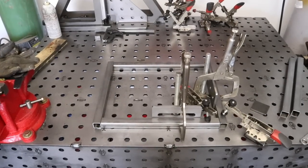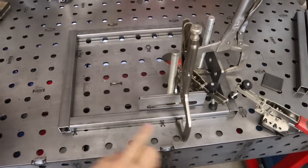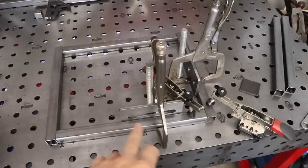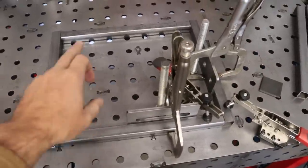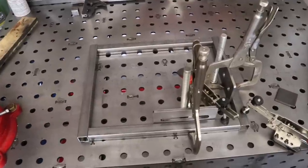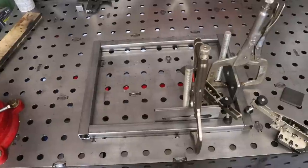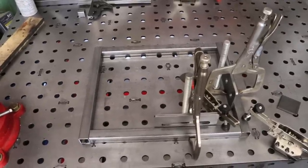Okay, so the next step is going to be making the top of the cart. These two pieces on the sides are just going to be your normal 13.5 sliders. These pieces here are going to be 14 5/8 front and back. And that's going to set your width for your totes. And I set this pretty close so that when they go in, they don't get cockeyed or anything, they go in straight. So that's going to be the most critical measurement, so make sure you cut those accordingly.